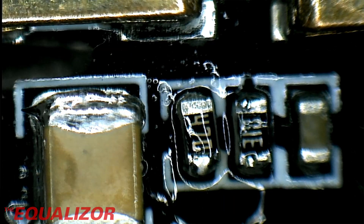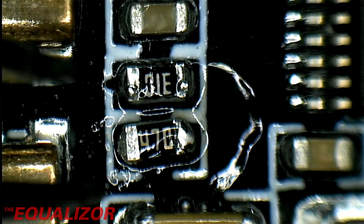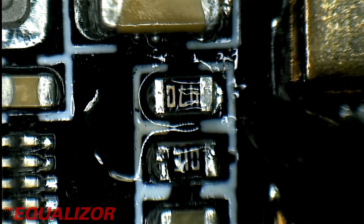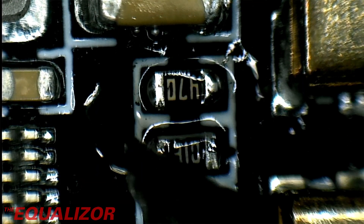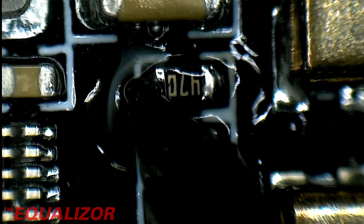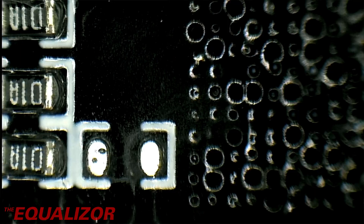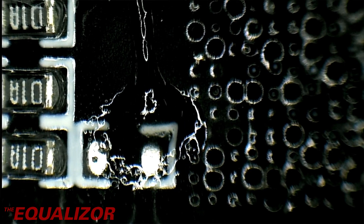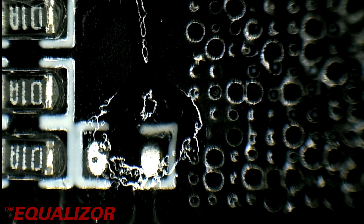Not in this case, obviously. I'm just going to touch the end of that with the iron, and on it goes. Doing stuff under a microscope can be a bit of a pain because you don't get a very good overview of the board — you're so zoomed in, and the camera's even worse because that's even more zoomed in. One of the reasons I'm not using hot air is because of these plastic connectors, and also I just think it will be easier to do them manually.